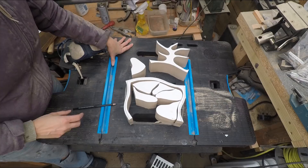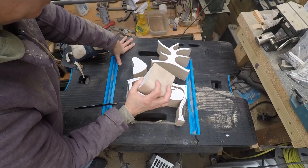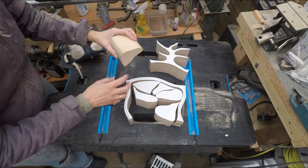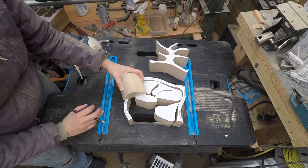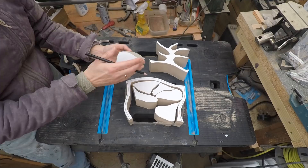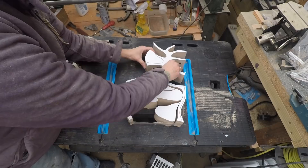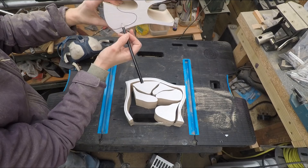That's all the boxes done now and they cut quite well - nice dry wood. Now I'm going to the bandsaw. First I'm going to draw pencil lines on this - as you know from previous ones, I always do them by hand, no measuring. We'll get the fronts and backs cut off these, then get ready for drawing out the drawers. Once I've cut the front and back, I tend to put it back into the mold so I can understand where the upright position is, and then draw the cuts out for the inner drawers.